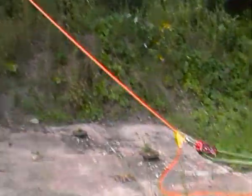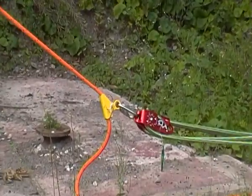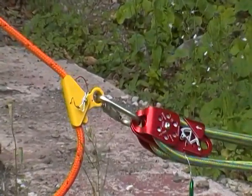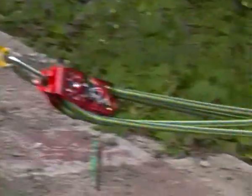At the top of the tree, the 16mm speedline rope is anchored. It's then attached to the green rope, which is part of the tensioning system, using the yellow rope grab. The tensioning system comprises of a double rescue hauler and a normal double pulley at that end.